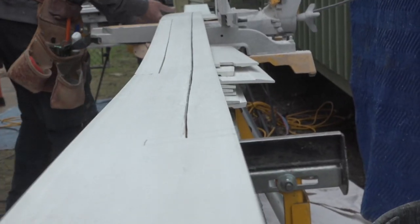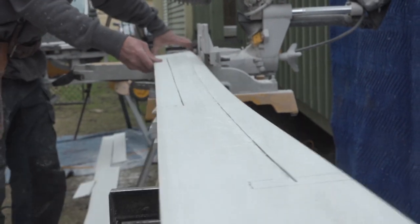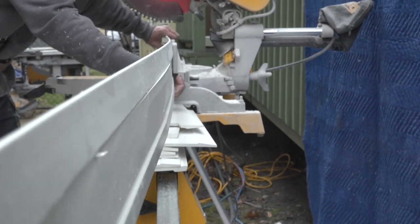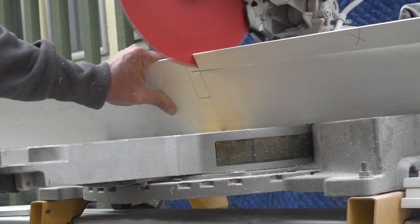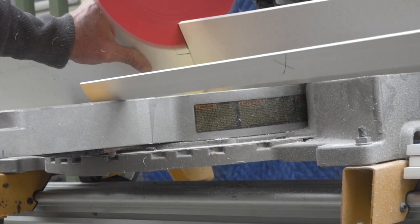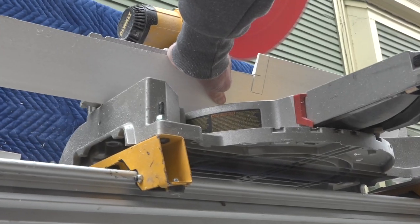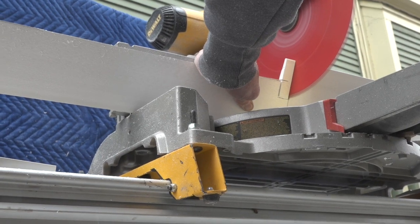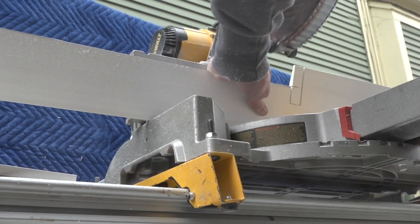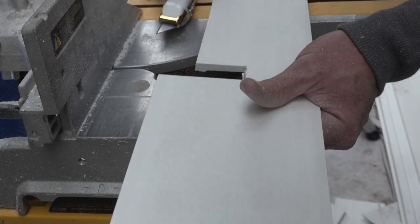Now it starts getting dicey. There's a lot of work invested in this piece, and there's still a bit of work to do. If it breaks while moving it around, it means going back to square one. Or two-piecing the siding in this instance. At the chop saw, he cuts the vertical edges of all the notches, tilting the workpiece to flatten the blade's curve at the ends of the notches. He finishes the notch cut with a utility knife, cleaning up the cut so they'll fit tightly.